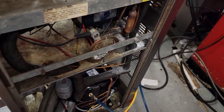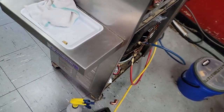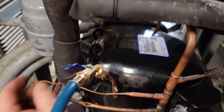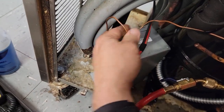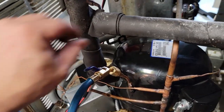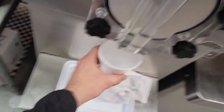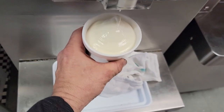Nice and warm. I need to grab some wrap insulation for that suction line. We're looking pretty good — running right in there around zero degrees at the evaporator. Looks like I added about four ounces total over the original factory spec. This machine is 20-21 years old — it was probably due to be replaced, but machines aren't available so we just have to make it work. Got that wrapped up, wire-tied for support so there's no vibration. I always like my loop more towards the brace point — it tends to vibrate less when it's not out there swinging. She just satisfied — we were running 235 on the head. Sweetness.